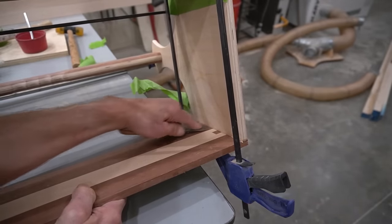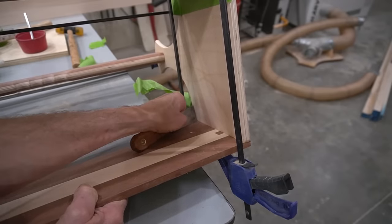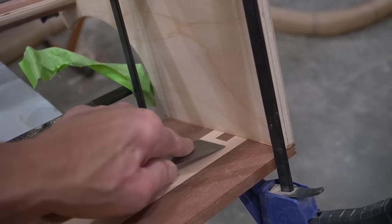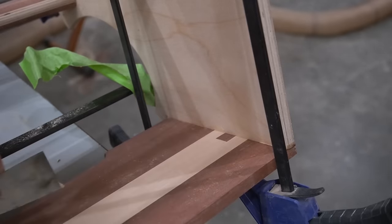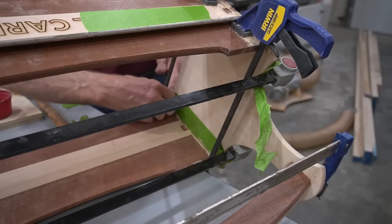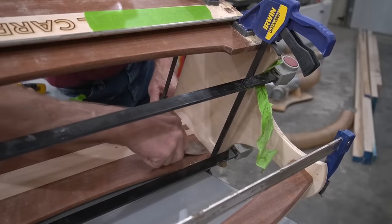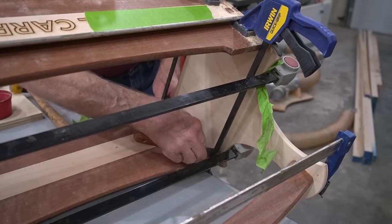And here's where tabs on the end of the frog tape make it easier to remove so that I can alternate scraping glue along the vertical grain on the end piece and the horizontal grain on the side pieces until all the glue squeeze out is gone and the joint is crisp and clean. And as I've been known to say, at times like this, I'll buy that. And for any non-believers in the audience, I hope it's evident that this method of glue cleanup is much better, much easier, and much cleaner than all the fuss required before, during, and after using water and rags for cleaning up glue squeeze out.